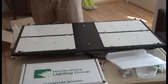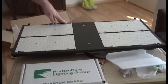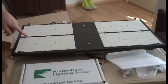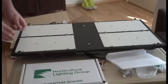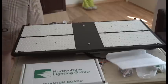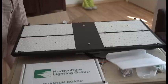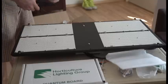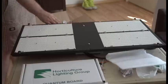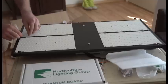Now we're gonna take a little bit of black wire. As you can tell, because we've done it, one corner is positive, so we're gonna take the negative opposite corner and wire that into the positive of the next board. So as you can tell, it's gonna be a little horseshoe like this. That's it. So we don't need tons of wire for that. We'll strip the first part here, like so. Perfect. Now we're gonna take that and wire that into the negative.